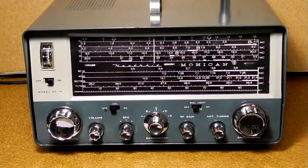I thought I would mention a few of the quirks and miscellaneous info about this radio. Transistors were brand new when the GC1 was introduced — the manual actually includes a section covering the theory of operation of transistors because they were so new. It uses germanium transistors on sockets. It's hard to find replacements for these as they're no longer manufactured. You may be able to use silicon transistors as replacements, but would probably have to make some minor circuit changes. Fortunately, all the transistors were good in my unit.